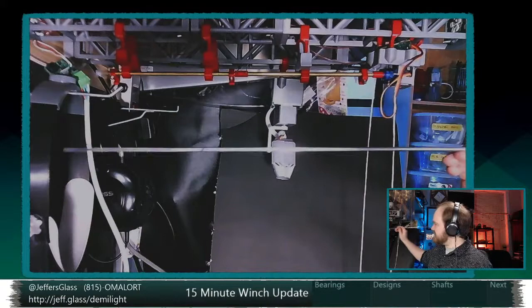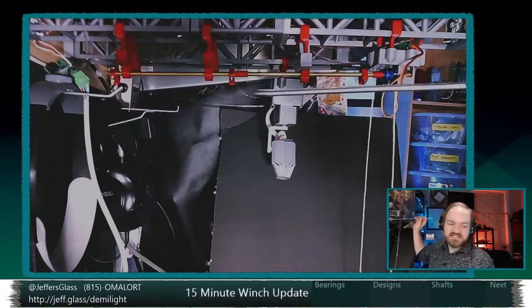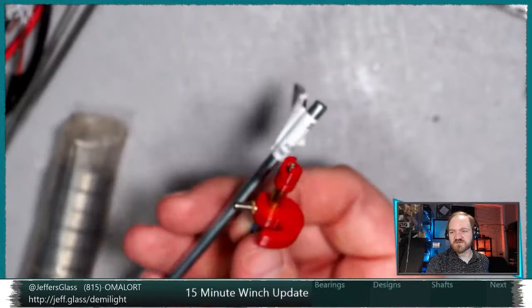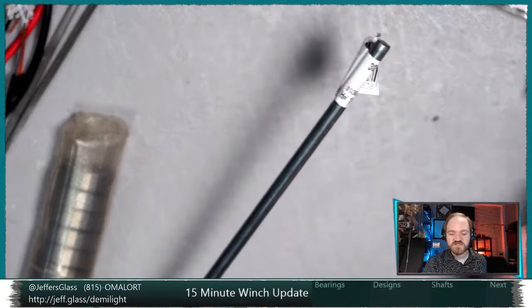So this might be our candidate for the operating pipe and the batten. Now we will have to refigure out, we won't be able to use the existing Thomas couplers to couple the mechanism to these, which Thomas so nicely developed for us. But that's okay. We know we have to develop some other coupling regardless. We won't be able to reuse the Thomas coupler idea because we're not coupling to a servo motor anymore. We're coupling to the end of a barrel shaft. So there would need to be some work anyway. So I feel okay about committing to doing a little bit more work on this guy.